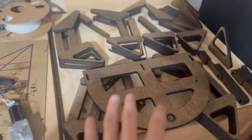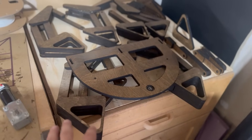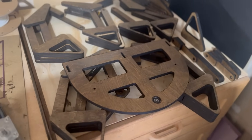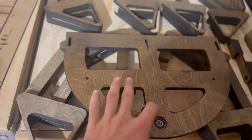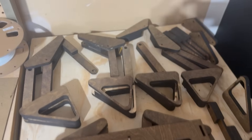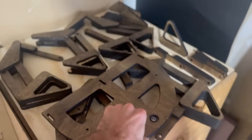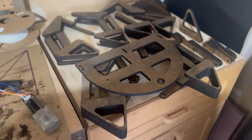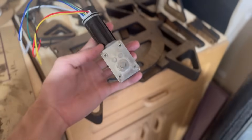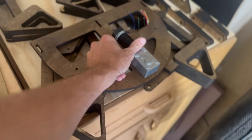We have about three legs done so far. One set consists of two feet, two hips, and all the struts for the center crankshaft, plus one of the divider pieces that go in between the legs. This divider has an 8mm bearing pressed into place, and then the motor screws onto the first set of legs, pokes through the divider, and out the other side.